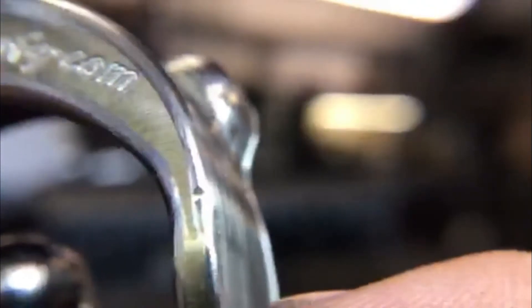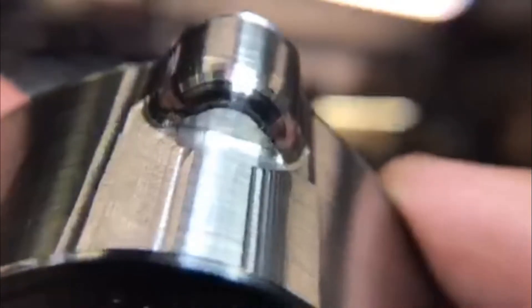The reason this one's no good is for one I have this gouge here — pretty deep, I don't know why. Even though I put 'don't touch surface, stay off two thousandths,' when I did my contour around that with the quarter-inch ball mill it touched that surface — same in there, it touched that surface. That's what made the part unsellable. I also changed the font and made it bigger.